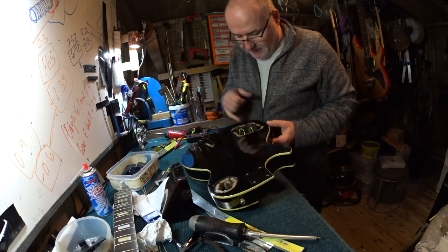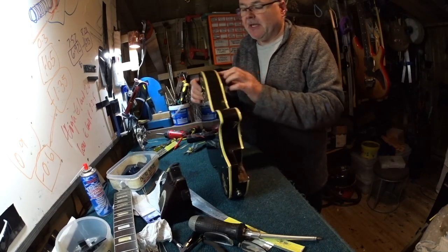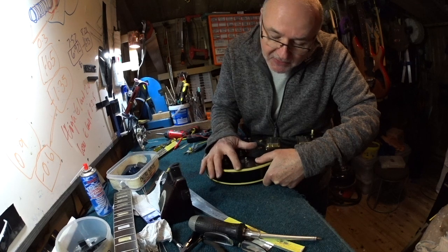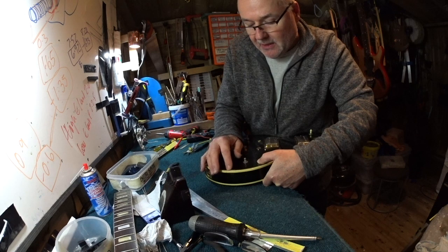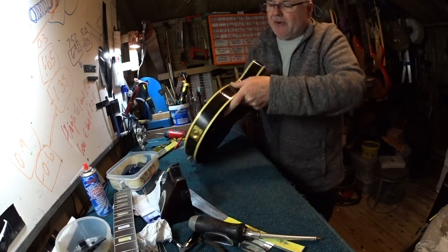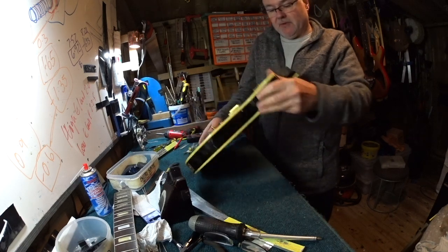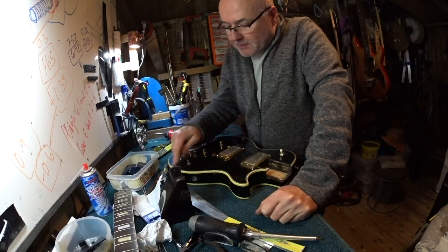So we do have a ply top. They've made the whole of the shaped bit ply, which is why this bit here is ply, and somebody's cracked off the lacquer when it comes down to it. We could do that up with glue even, or we could colour it. We could put a tinted lacquer over it and build that back up. And no doubt it's an old poly finish, it wouldn't be nitrocellulose or anything like that. That's not a big deal.